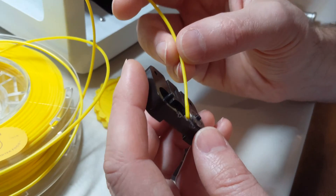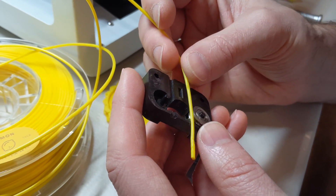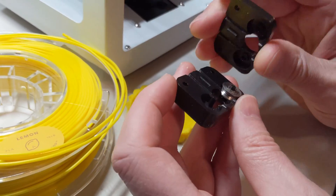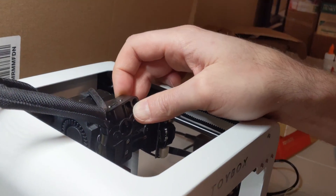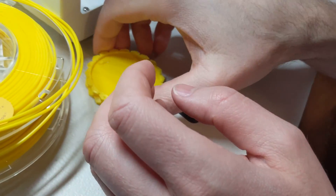I want this gear to grab on the filament — it should move freely, but also keep good pressure on the filament. I'll clean that up with a Q-tip and see if that fixes the issue. Then you just put this piece back together, slide it back on, put your screws on, and we'll do a quick test run to make sure we're extruding correctly.